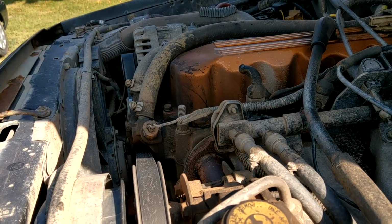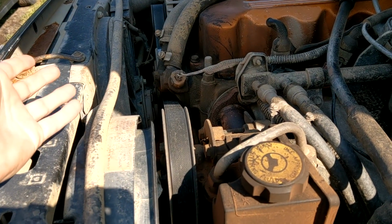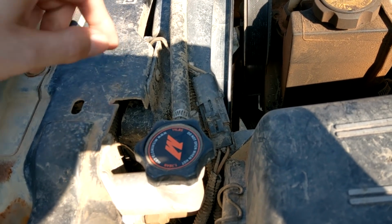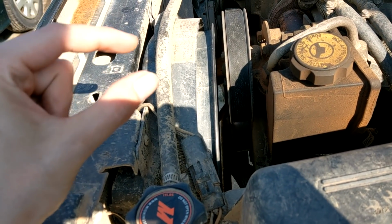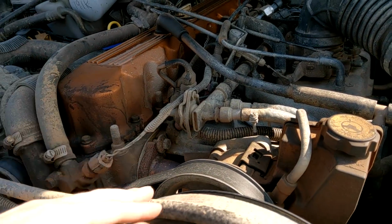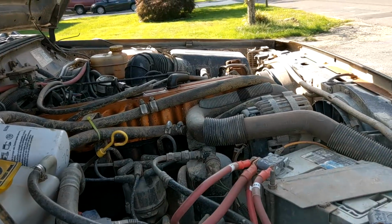This guy over here has about a 16-second delay from the fan turning on to noticing a temperature drop. That means your temperature is going to sweep back and forth very high because there's a long delay. It takes 16 seconds for this cold fluid to go through the engine and get to there and go, hey, I'm getting cold. By putting it right after the fans, this is about a 3 to 4 second delay. See? With that, it cycles on and off at a faster rate, so you stay within a tighter band of temperature. And with some smart delay prediction, you would go, this has a 16-second delay, so we'll turn it on and then try to predict when to turn the fans off so it doesn't overshoot and undershoot. That's complicated. I haven't done the math yet, but it is possible. It just depends if anyone needs it.